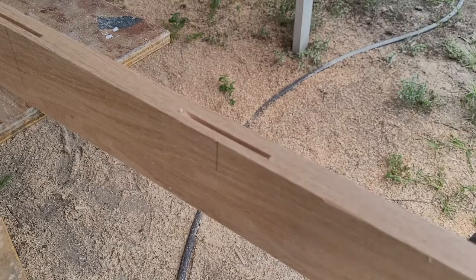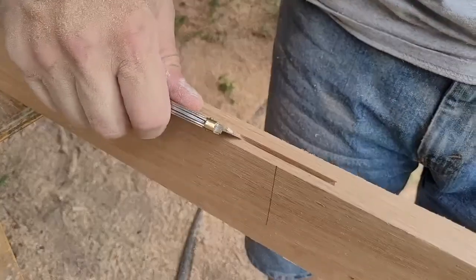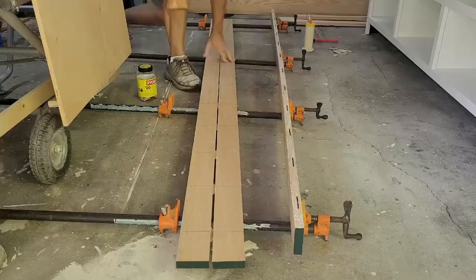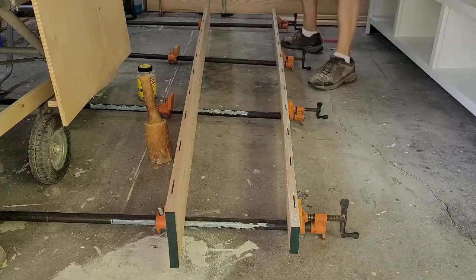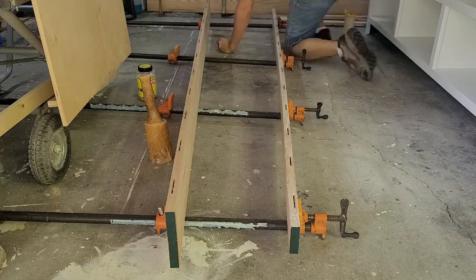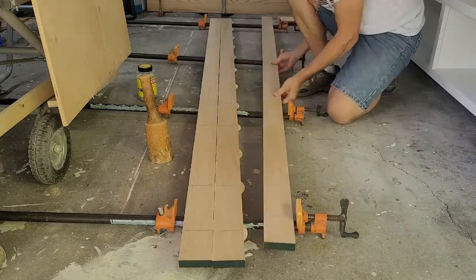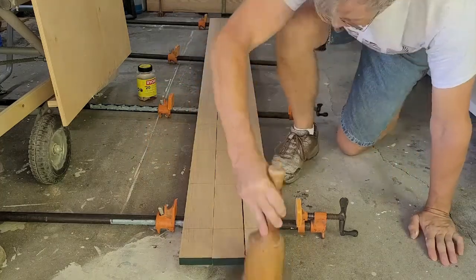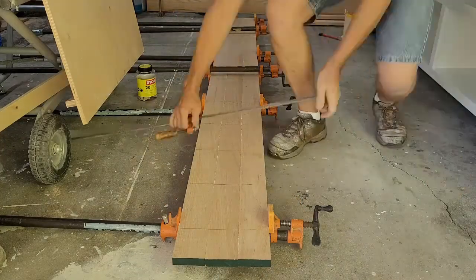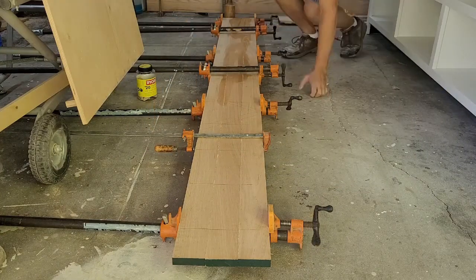Before gluing up, it's worth checking your slots for any burrs you may have created — sometimes you can remove them with your finger, while others may need a knife or chisel. With the clamps in place, it's time for glue. Add glue to each slot and along one edge, add your biscuits, squeeze or tap your pieces together. Repeat until all your stock is assembled, then add clamps while the glue sets up. The total width of this top is too wide for my planer, so I split the glue-up into two sections. I wiped off as much excess glue as I could to make cleanup easier later.